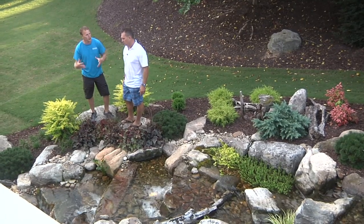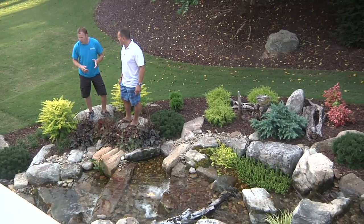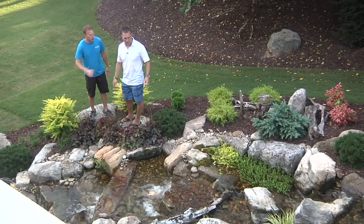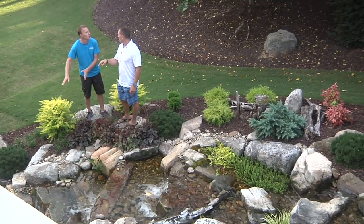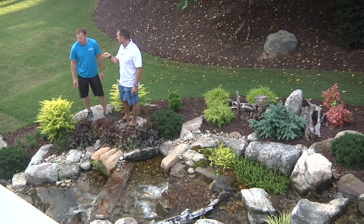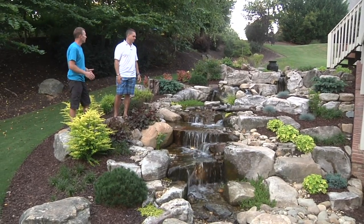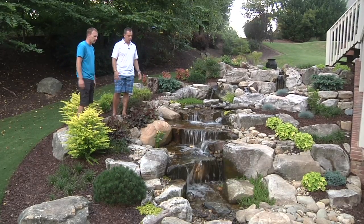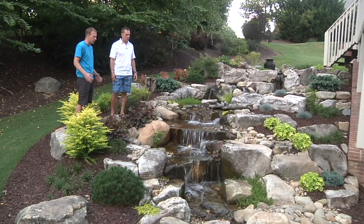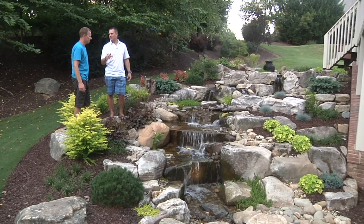That's the reservoir — it's all that water that's underground. What size basin did we put in here? We went with just a six to seven hundred gallon basin underground, so you're only seeing a portion of the water. It's all going underground where it's shaded, where it's cool. The majority of the water is underground and that's the key. Because the fact that it is shaded, the algae's not going to grow. How many aqua blocks did we use here? 16. So about 500 in the reservoir, plus another 100 with rocks and a vault — about 600 total gallons. And not one time has this been filled.